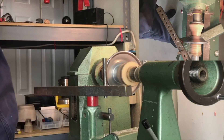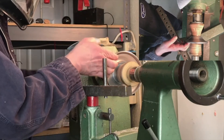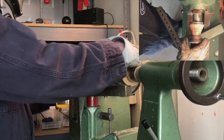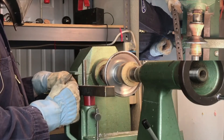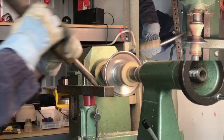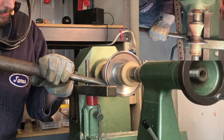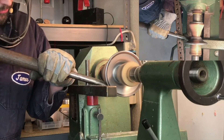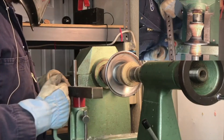That's looking good. If you want to check the edge to be sure it has a nice feel, make sure you turn off the lathe and turn it just by hand. Also, because of this rolled edge the structural integrity is preserved, so if you decide you want to refine the curvature out here you can still go ahead and do that. There's still some lubricant there — let's say you decide you wanted this curve to be a little smoother, or you want it a little bit further down raising higher off the table. Not a problem. I'm not going to fuss with it too much just for this quick demo.